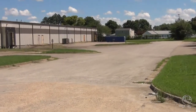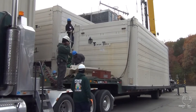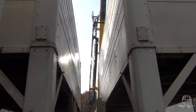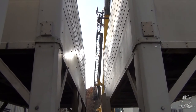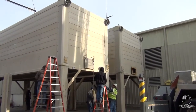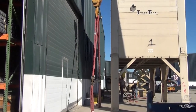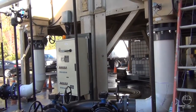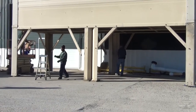If there is any question whatsoever on your selected site, contact your rental coordinator for further assistance as soon as possible. Waiting until the unit arrives is not the time to realize there is a site condition that could delay delivery. Each TowerTek module has a footprint of approximately 12 feet wide by 34 feet long. This does not include any area for connections and ancillary equipment. Concrete or asphalt areas are required for this installation, as the design requires a solid footing for proper weight distribution.